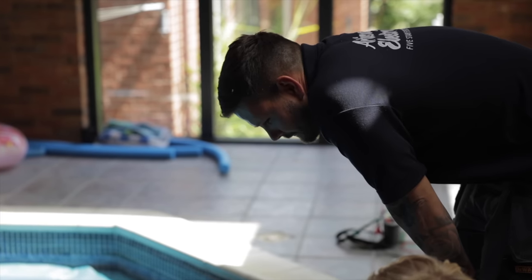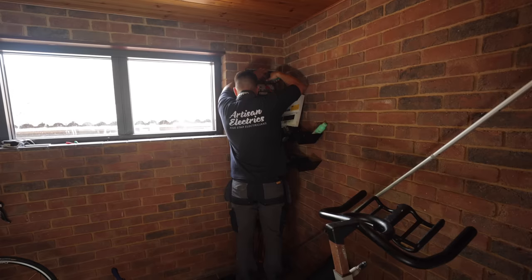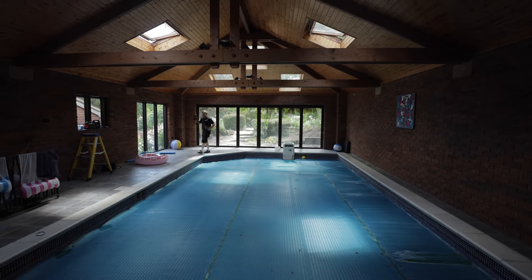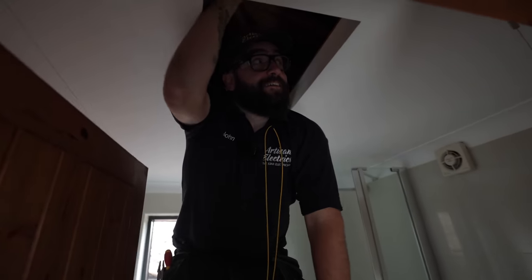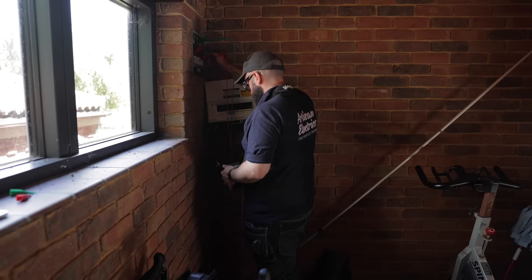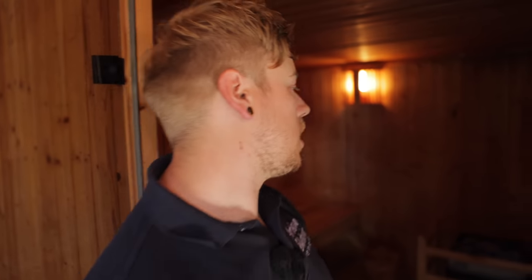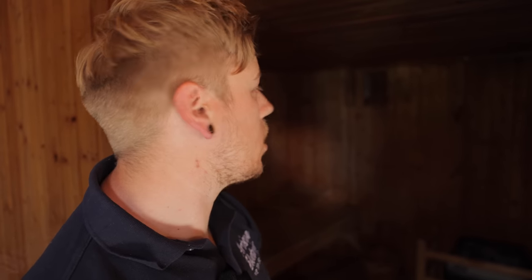Squeezing through a tight access point — so many cobwebs. There's a transformer and a light up here. As I mentioned earlier, you don't want any equipment in the sauna zone other than the light itself. This pull cord actually goes through and is mounted to the ceiling right above the sauna — well out of the zones. So I'm happy that's all safe. We've got the isolator in the pool pump room so we'll go get our R1 R2 from there.